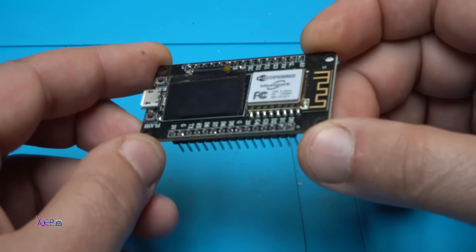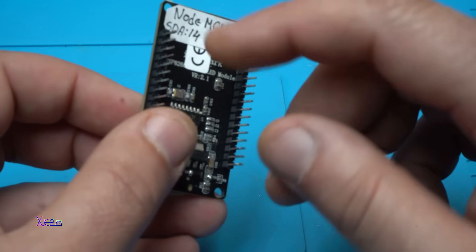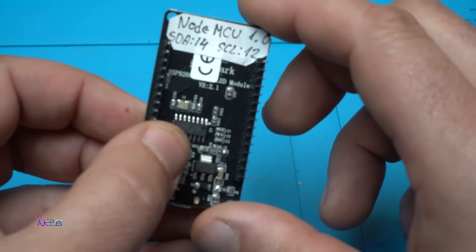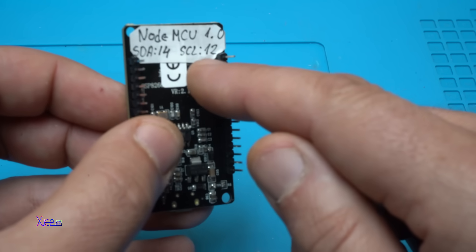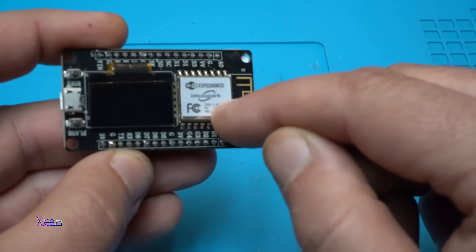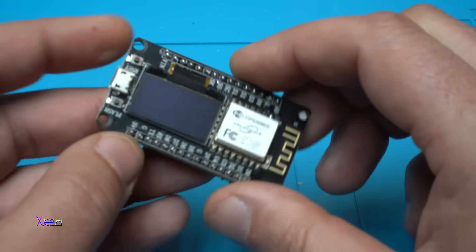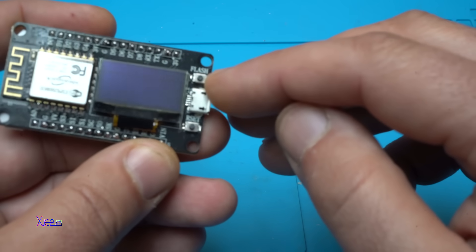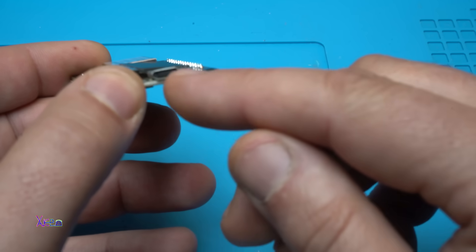Take a look at this beautiful board. I wrote some notes on it: NodeMCU 1.0 — that means it needs to be selected in the Arduino software. The Serial Data Pin is on pin number 14 and Serial Clock on pin number 12. Beside the ESP8266 chip we have an OLED screen with 128 by 64 pixels. We also have two buttons: one is Flash and the other is Reset. The Flash button can also be programmed for other things, maybe for playing games. I chose the Micro-USB connector, but it also comes with Type-C.